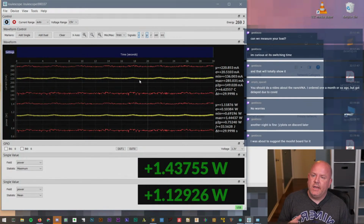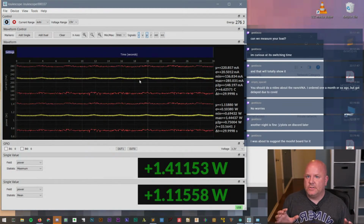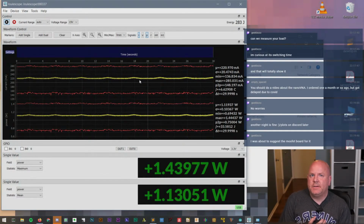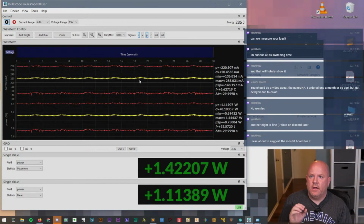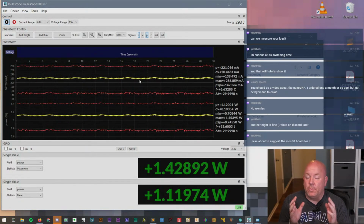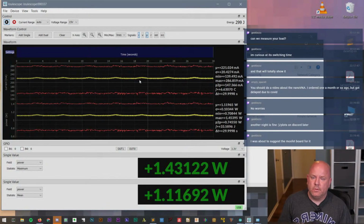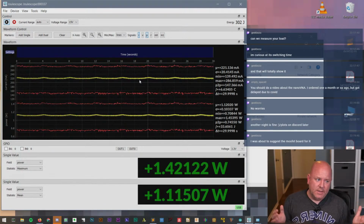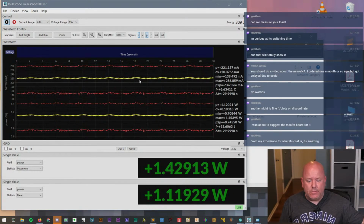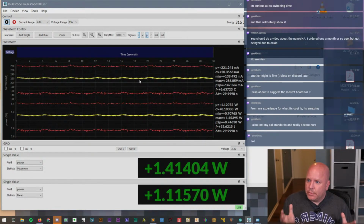But what I want to do on the Nano VNA is compare it to a real VNA and just help people understand what its accuracy and limitations are, but also understand what you're getting for $80. I think some people rely a little too much on the numbers it gives, but I also think that for the price, the numbers it gives are really good. It's just I've seen on forums where people are super excited because they say, oh, my SWR is exactly 1.2 at 4.7156831 megahertz. It's like, nope, it's not that accurate. But it's pretty good.